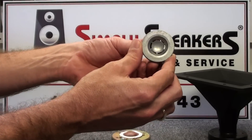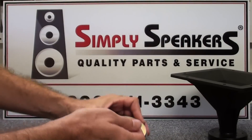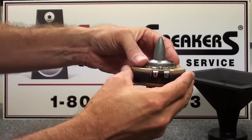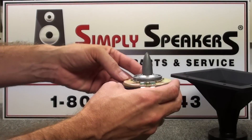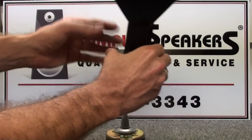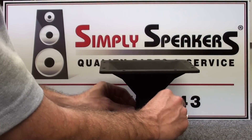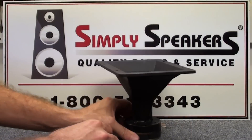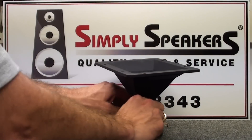Note that the phase plug has a couple of notches to allow for the lead-in connections on the diaphragm plate. Make sure you line up the center nodule so that the open notch areas are where the lead wires run underneath the diaphragm, to prevent any shorting of the diaphragm assembly. That just sits in place. The lens, because it is notched, only goes back in one direction — it sets down in place just like that. Then put the four screws back through the top plate, doing these one at a time, tightening by hand until they stop turning.